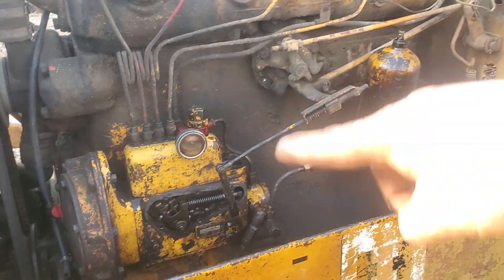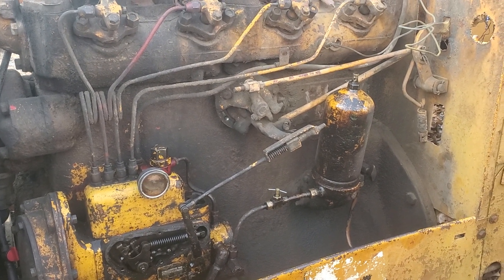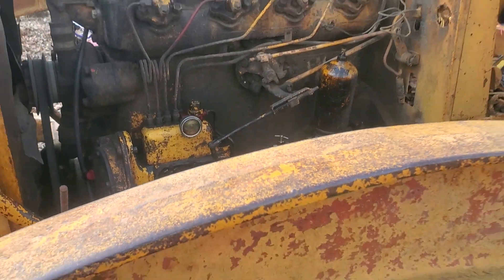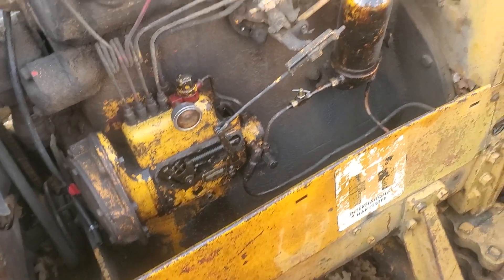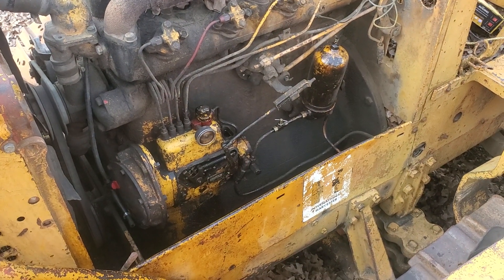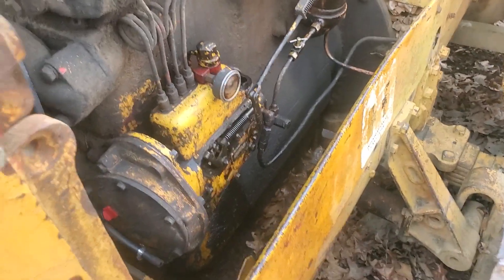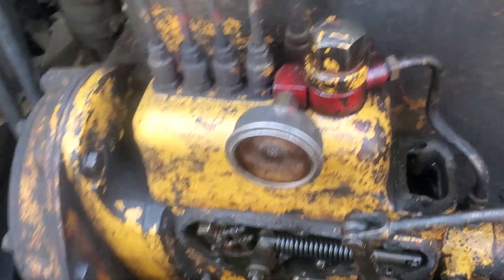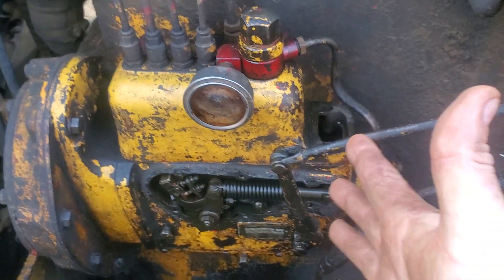The way I understand it, I have what they call a Bosch injection pump, and that is based off of the single filter setup over here — that's what I've been told. This is supposed to be a 1947 TD-14, not a TD-14A, not a 141 or 142, but a TD-14. According to the numbers I've been able to find, that is exactly what it is.